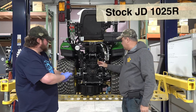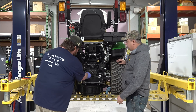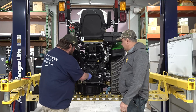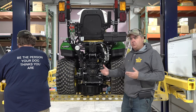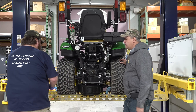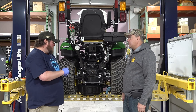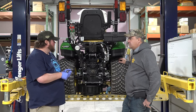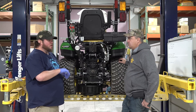This particular tractor is not Johnny X — it doesn't have the Hydros Plus kit on it. The plan is to install this temperature gauge on both tractors so we can see if there's any difference between the two. It'll be hard to judge since we won't have both tractors on the same application at the same time, but hopefully over the longer term we'll have actual data points to compare. Matt has been running one of these on his system — an early 2017 with the 260 and H120 loader — for about 100 hours, and aside from some growing pains and wearing hydraulic fluid a few times through his own fault, it's been very reliable. The data shows it operates about 100 degrees above ambient under load.